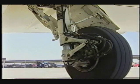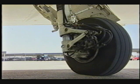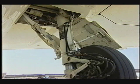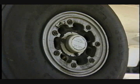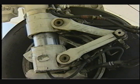Verify that all cable, hydraulic, and electrical lines are secure. Inspect the doors for signs of damage and security. Check the tires for signs of tread wear and ensure there are 7 bolts on the wheel. Verify the strut extension is within limits.